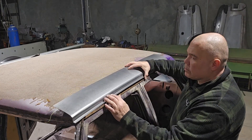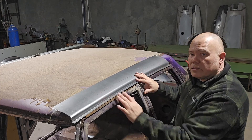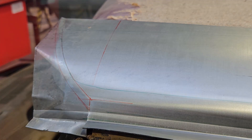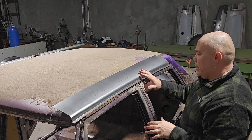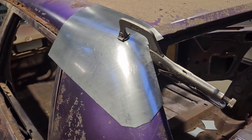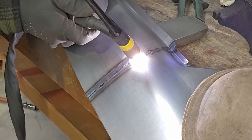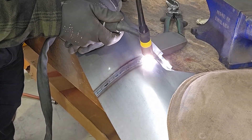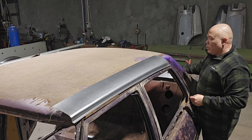There's the piece. If I just sit that in there, it's pretty close to being ready. We have to radius the front edge and make that fit the screen opening, and really apart from that, it's a finished piece ready to weld into the car. Then we just finish it with an end cap, which gets welded to the side and sits in there. That's still going to have a bit of detail put in it as well, but that gives you a good idea of where we're up to.